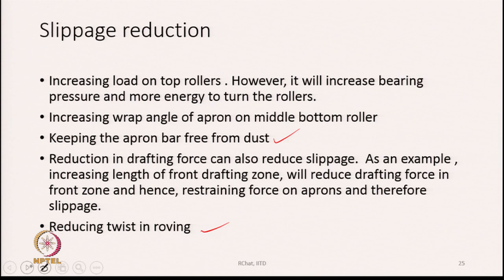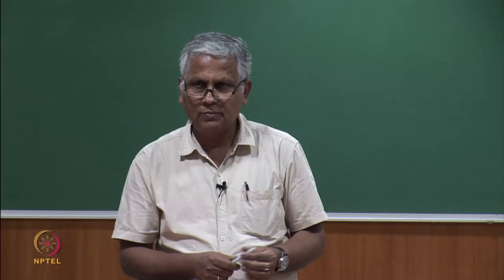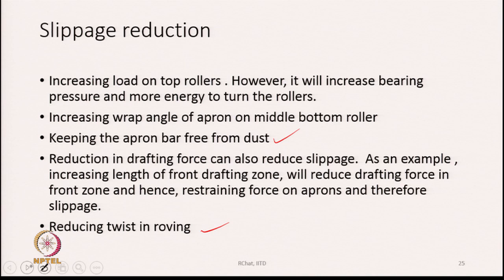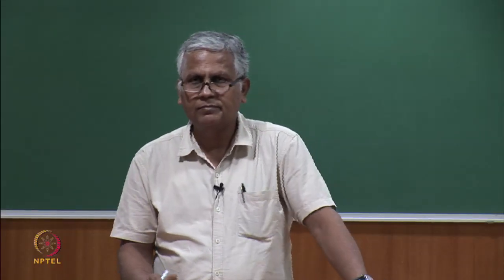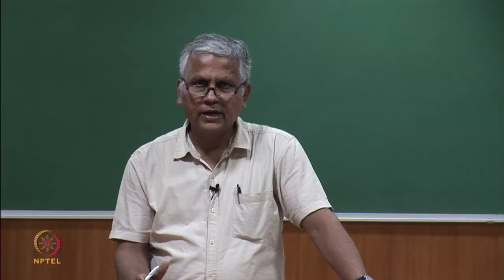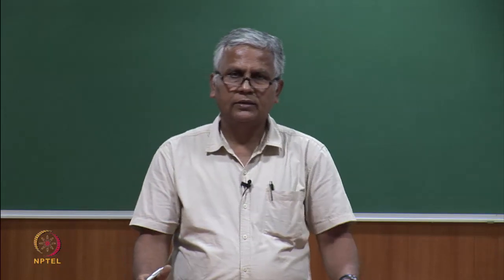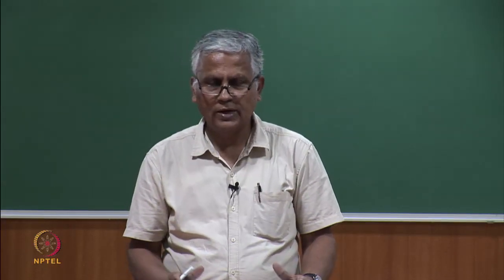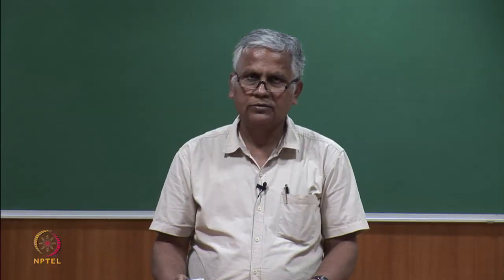And with this we close this session on drafting. So, we have to see that there is a possibility of slippage also in the case of drafting aprons. The other things that we have discussed are how much draft we should keep, what are the various factors which affect the selection of draft, then what should be the draft distribution, importance of break draft, the stick slip phenomena, and the role of your roving guide, why they are given oscillating motion, all such things we have discussed. And with this, let us close today's session. Thank you.